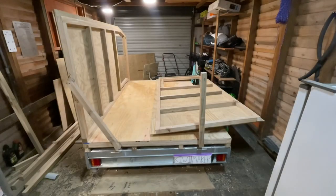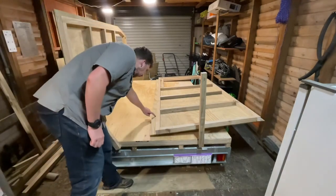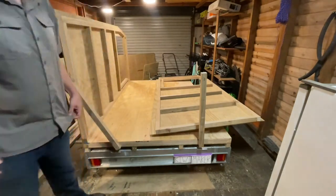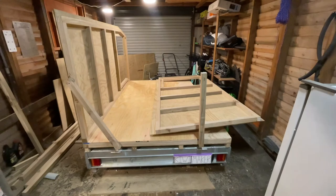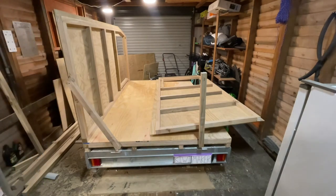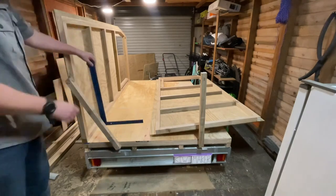I hope you all realize it's not as simple as it seems in the video. The walls come up and come down a lot of times that I don't video. In this case, I put it all together and it seems to fit well — everything's the right length. So I'm going to now glue along here and here, then slide it back in place and put screws all down the side. Then I've got these bits here to square it up — that's where the squares come in very helpful.